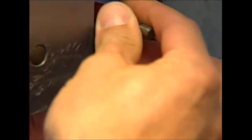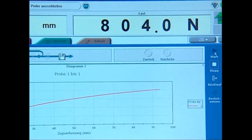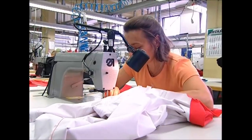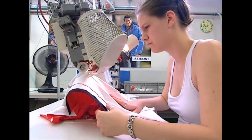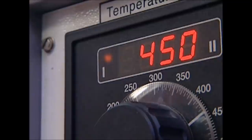As well as abrasion, the material's strength is also tested. A cloth sample is loaded into a machine that will stretch it to breaking point, and the force required to tear it is measured to assess the material's quality. Meanwhile, the finishing touches are being added to the jacket. One problem with sewing Gore-Tex is the stitching — water can get in through these holes, which are huge compared to the material's microscopic pores. However, a liner is heated into place, which seals the stitching.